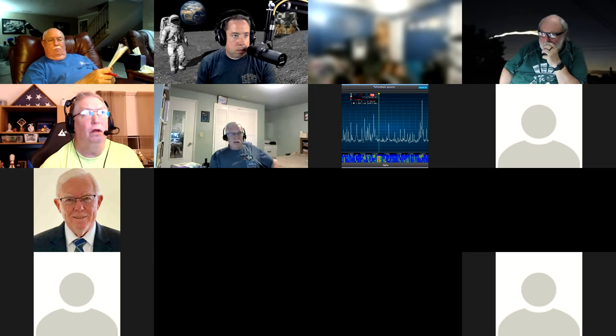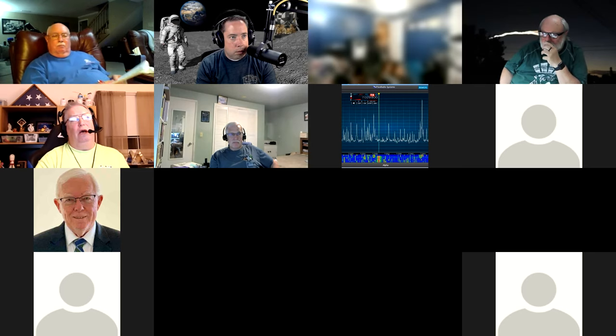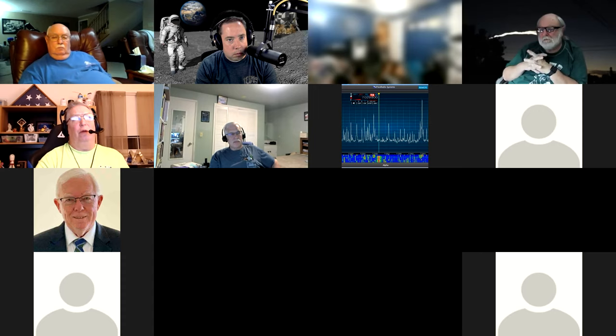Yeah, so I would say with the transverters, probably the best thing to do is you leverage the BCD data or the bit data coming off the USB cable off the back of the radio when you set up the different bands in the transverter menu on the radio.